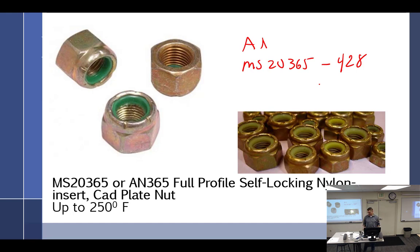4313? Tell us about it. I just remember seeing that torque chart. It has a chart. In order to reuse a self-locking nut, it must meet the minimum prevailing torque, which is to say, it must have a minimum torque to drive it on. For example, I changed out the seat in my carburetor and it has a strip of nylon on this seat and it says right in the directions, you must have a minimum of 5 inch-pounds turning it in. So I get a small torque wrench, set it to 5 inch-pounds, and it better click while I'm turning it in, proving that it reached 5 inch-pounds while it's going in.